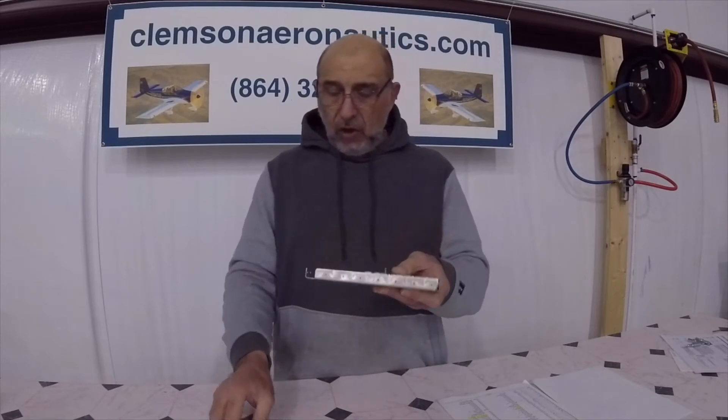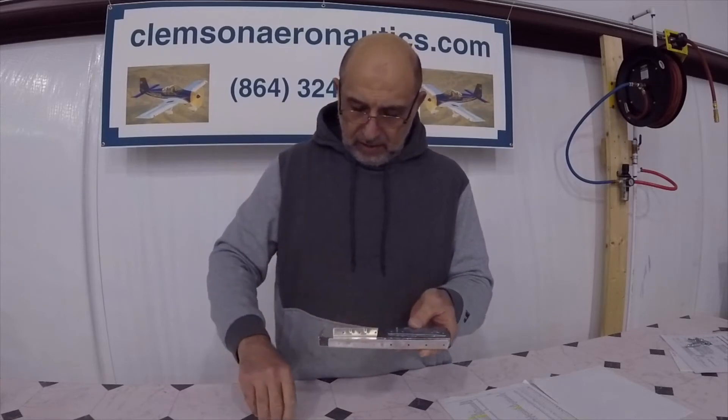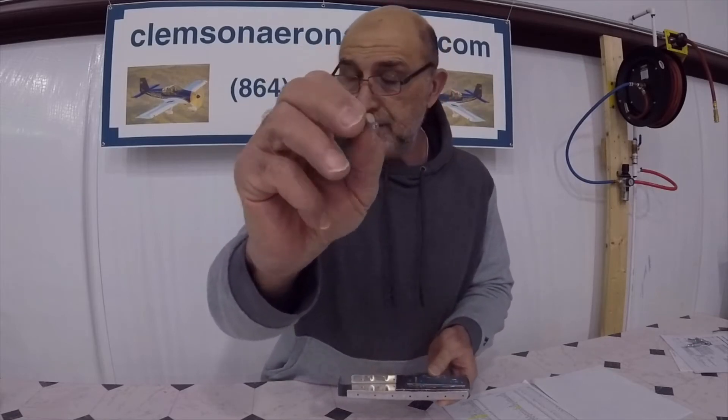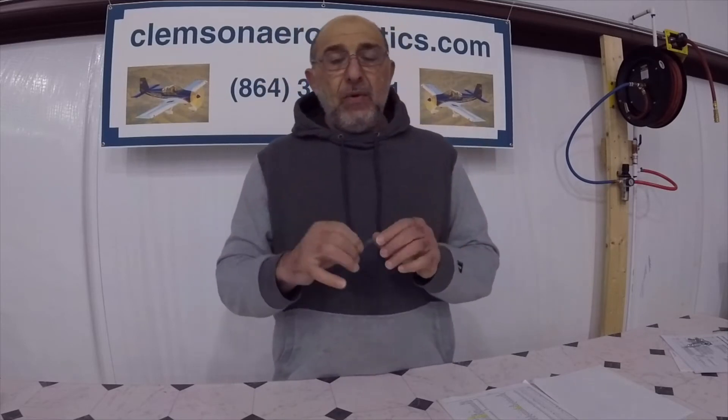After you have the screw going through it, what holds it in place for life is this piece of aluminum here with this nut plate. Somebody on the internet had a question asking what keeps the screw from falling out — that question tells me he doesn't know that this nut plate is a self-locking nut plate.